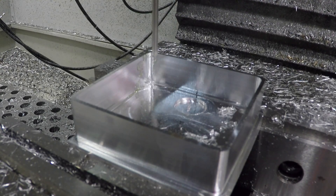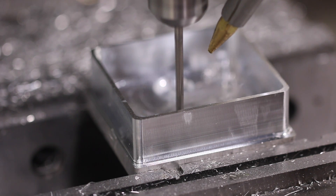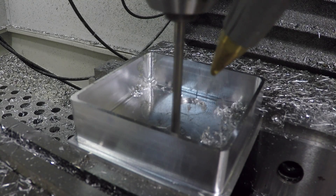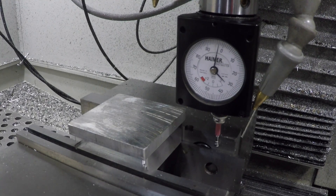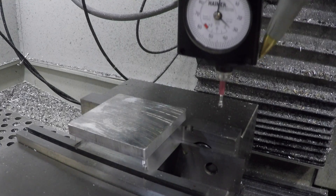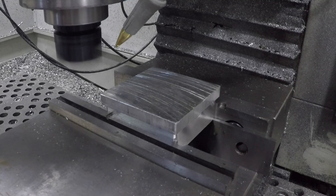That drill definitely walked on me a little. I knew I wasn't going to spot them — we'll see, I don't think that's going to be a problem but it's not a recommended machinist move. We flipped the part over. We know we want it to be 0.7 inches tall. So come down here, find Z0 — this is where I love the touch screen, it makes it fast. Type negative 0.7 and we're good. Come up and we'll use our Superfly. 2,500 RPM. I'm just going to turn the coolant on and jog at 20%, taking about 100 thou depth of cut.